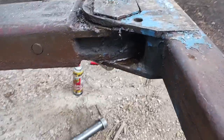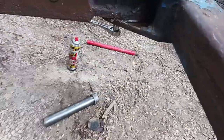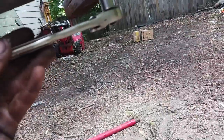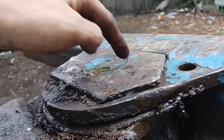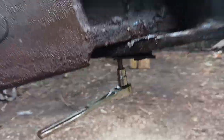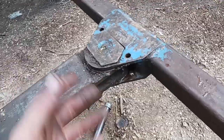On some models you can actually tighten up that bushing — there are some pins and stuff that are adjustable. Right now I'm going to be cleaning all this up, figuring out what I need, and checking the condition of everything. I've used PB Blaster, a breaker bar, and a lot of heat to get these bolts free without busting them, so I can drop this bottom block plate out, pop this bushing — which is welded to this giant piece with a tab so it doesn't spin — and then clean it and make it functional again.